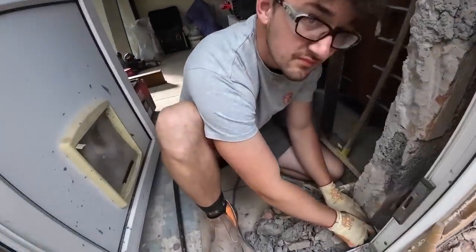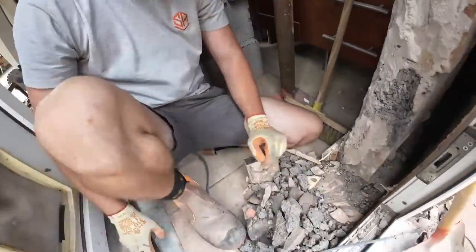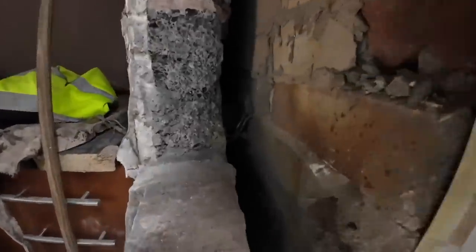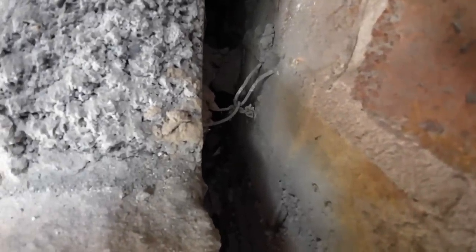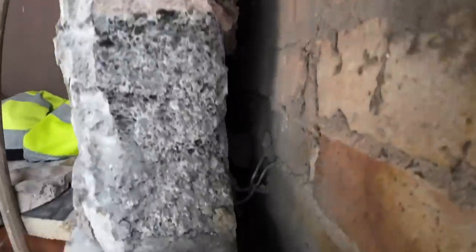There you go. That piece of brick is a cavity closure, the rest of it was just rubbish in the cavity. It's still the tie wire. You think that tie wire is running external to it? Internal to external, I don't think so. That one does. I'll give the tie wires a bang because they're all covered in snots as well. There's another big snot in there.